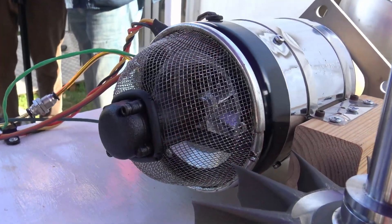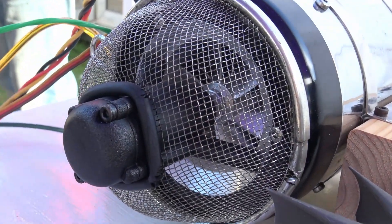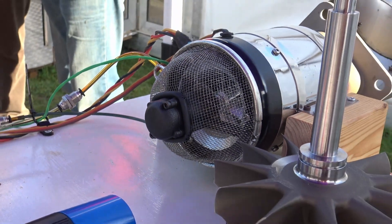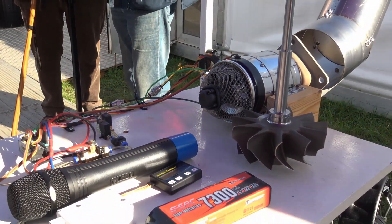We'll give a quick run. It's exactly the same as the engine we ran earlier — centrifugal compressor at the front, axial flow turbine at the back, vaporizing combustor — but this one is very similar to the turbofan in that it's kerosene only. It's got the pilot Kero burner which gets the whole thing started, and then the main burners switch in once the combustor assembly is up to temperature, and then the starter burner turns off and it runs on the main burners for the Kero.